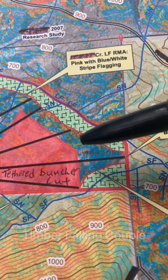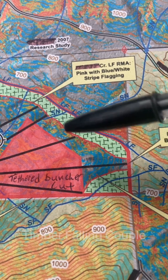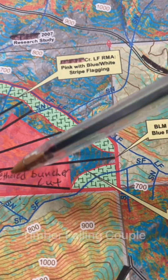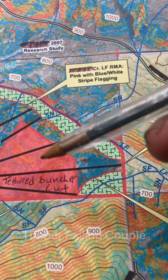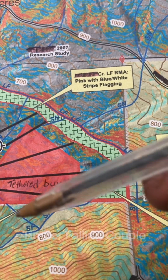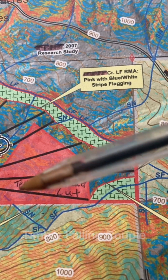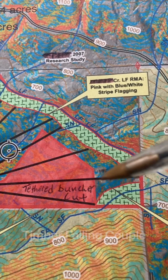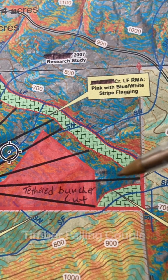In general, I was able to keep my lead pointed all this direction with butts on this left end, and that helps the logging because they're going to log in a downward direction, down this slope. There's a draw here and a draw here — both draws, small fish creek, small non-fish creek. As they log down towards this area, they're coming down on butts and logging butts up. This was 24-inch buck and there was some really big, nice wood in here.